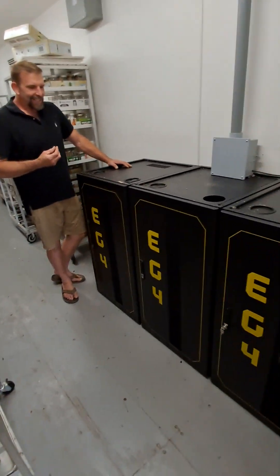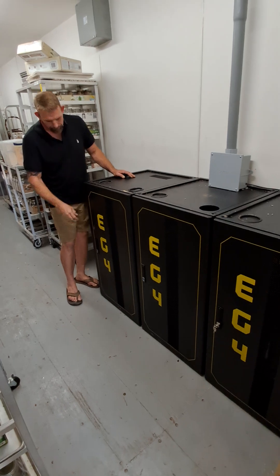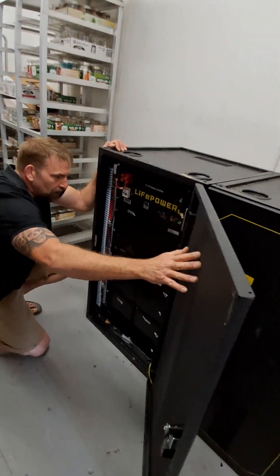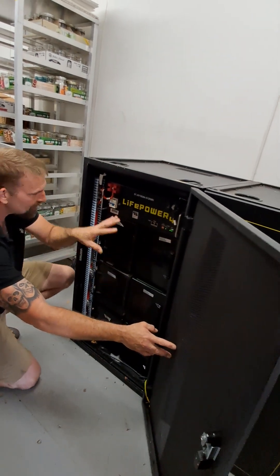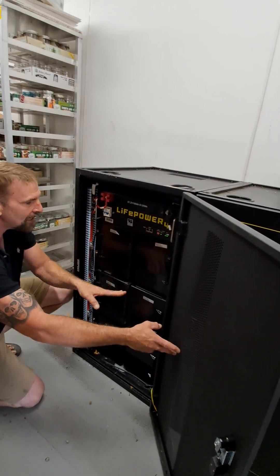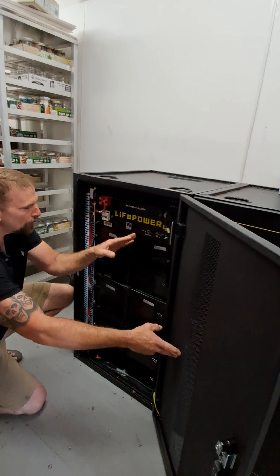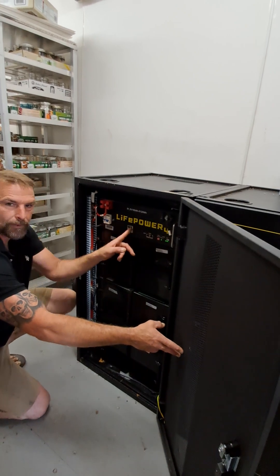The customer is an interesting one, just like they all are. He wanted 100 KW or he wasn't going to do the deal, so I had to engineer an extra 10 KW to go into these cabinets. What we did was use 200 amp hour golf cart batteries — same voltage, same platform, same everything. The BMS is a bit more robust because it's for golf cart instead of home applications, meaning 200 amp output compared to Signature Solar's 48 volt 100 amp output. With this combined application, we're able to store and do a peak power output for 32 seconds.